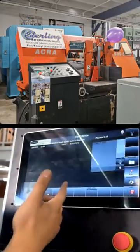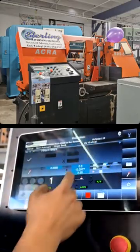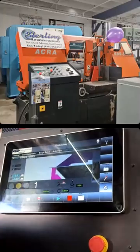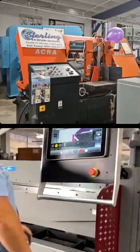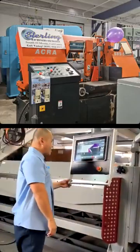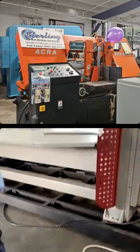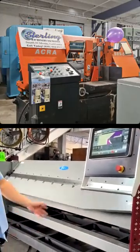So that piece calculated, there's no errors that went through. So let's go ahead and go through 2D graphical for production. We're going to stop, reset, start. So now right here, you can see this is just the beginning of the hem. You just press the bend pedal twice. And right here, it's ready to bend. Right now, I just clamp down to the sheet of metal. Then it's going to go ahead and bend. I don't know what degree that is, but that's just for the hem.